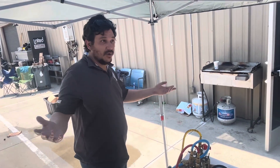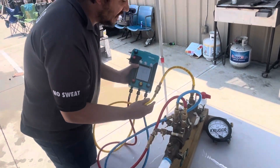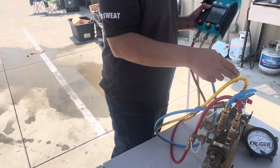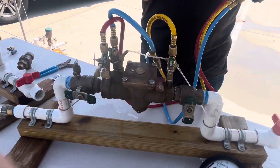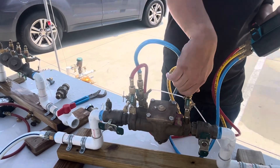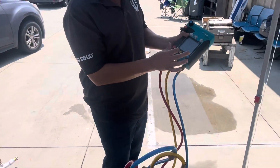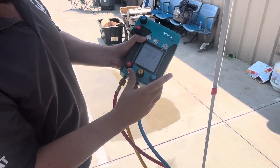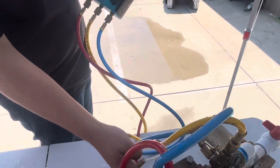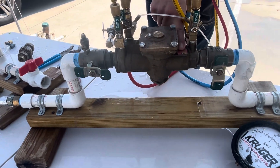Some people like P-CORE — purge, connect, open, reset — since there are bleed tees and all kinds of things to bleed. But we got there and now, like I said, we're only two steps away. We're going to put pressure in here to see if check two is working. We know that if we put pressure in the number three test cock it's going to make the relief valve open. We put pressure in the number four test cock — is it going to make the relief valve open? Let's see. We open our bypass, so now we're pushing high pressure into test cock four.